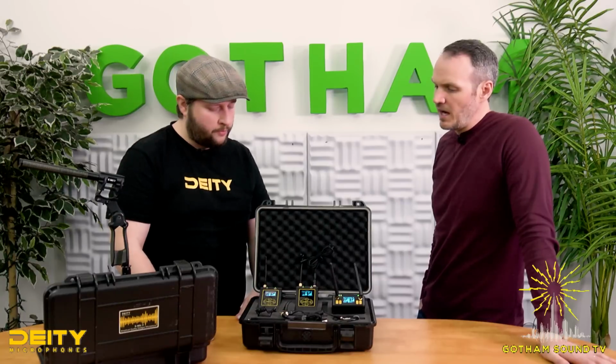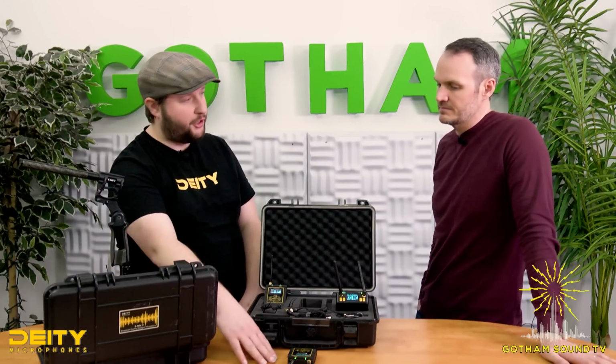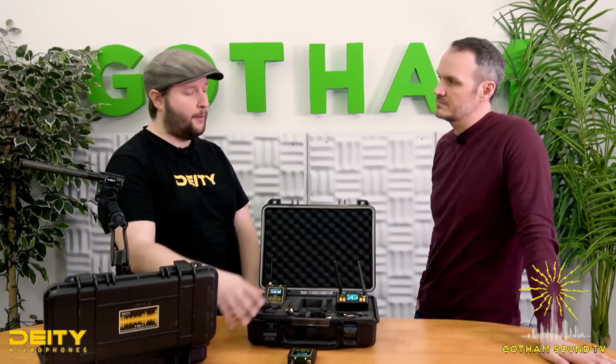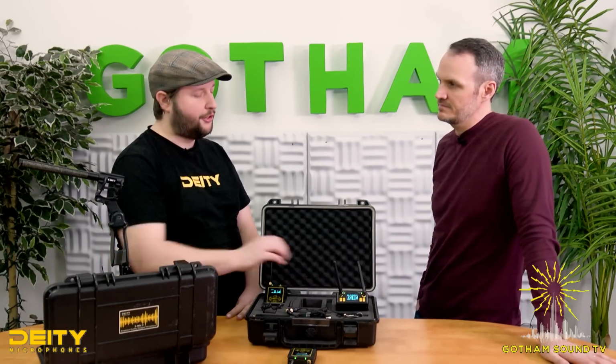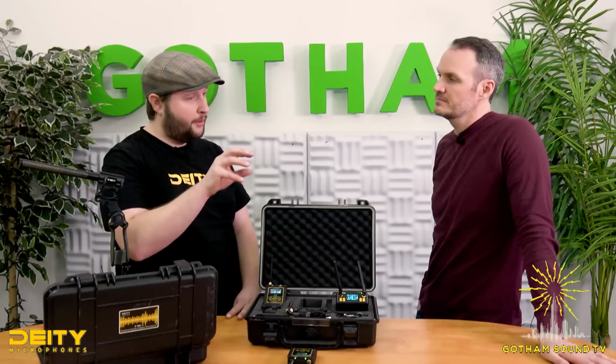Absolutely. Cool. Now, one thing you were mentioning that was interesting is there's a 19 millisecond latency in the transmitter. What that allows us to do is, if we ever do a bad frequency hop, because the system is always hopping, and the system goes, hey, I didn't get all the data I needed, the next 2 transmissions include that missing audio, timestamped. As soon as it goes into the receiver, it reads that timestamped information and reinserts it back into the stream like a buffer system. It's like having anti-skip protection on a CD player. You can hit a pothole in your car, but your music never stops playing. We have the same kind of system.